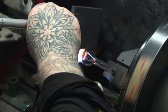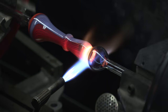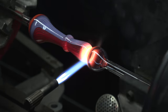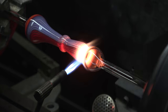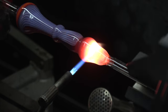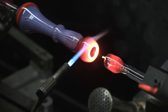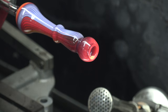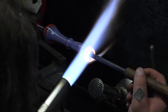Heating up the tubes a little bit and straightening them out with my paddle — now ready to go in and make the seal. Heating it up with my Lynx flame, pushing the tail stock of the lathe in just a little bit, pulling it back out, and there's your seal. Now I've got it nice and connected; going to blow that out a little bit and make sure that's a really nice smooth transition. There's a blow hose connected to the other end of the neck section — one is a blow hose and one is a plugged blow tube. Now doing a flame cut, just heating up as you pull away — and a nice even lip there. That's blue Stardust again for that color — matching the color on the bottom to make the whole piece cohesive.